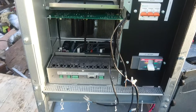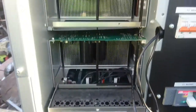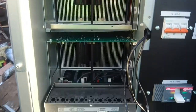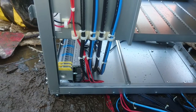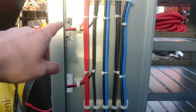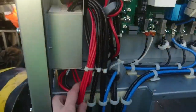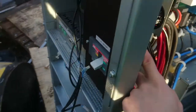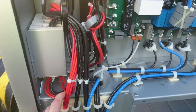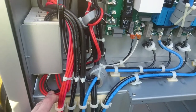With the front cover removed, we can see down at the bottom the input rectifier module, and above we have three identical output modules. From the input terminals at the bottom we can follow the wires running up the unit. First we can see the four connectors for the battery banks. The red wires are from the batteries — they run up through the large 160 amp automatic breaker. They loop through a couple of times for distributing the load evenly across the breaker so it can shut down properly.